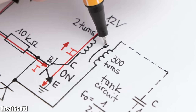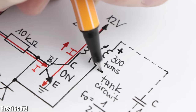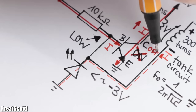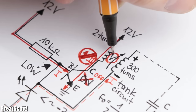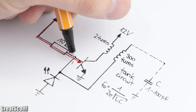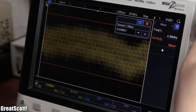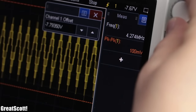At this point, the induced voltage creates a positive potential on top of the coil and a negative one at the bottom. Once the negative voltage exceeds the forward voltage of the diode, the base of the transistor is pulled low, and thus it turns off, which therefore stops the current flow through the primary and the voltage induction through the secondary. Afterwards, base current can once again enter through the resistor and the process starts all over again. Due to the resonance circuit on the secondary side, a sinusoidal voltage and current is created, in this case with a frequency of around 4.3 megahertz.